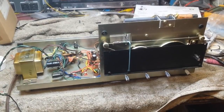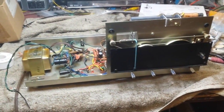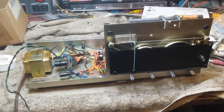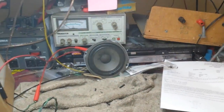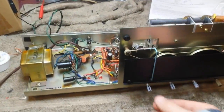It's got nice simple controls up front. I just got done recapping it, so what I want to do now is hook a speaker up to it and see how it's working. If it works well, then we can work on the alignment and stuff. We've got our speaker hooked up — actually a CTS driver from a Bose 901 Series 1, supposed to be pretty good full range. We've got our chassis and our primitive FM antenna, so let's see what happens.